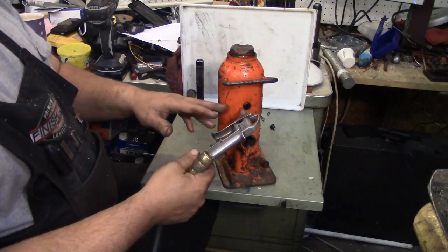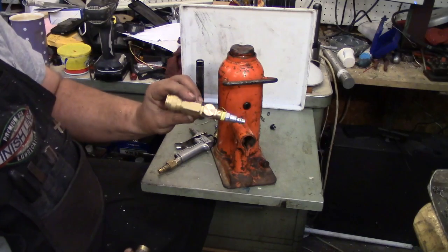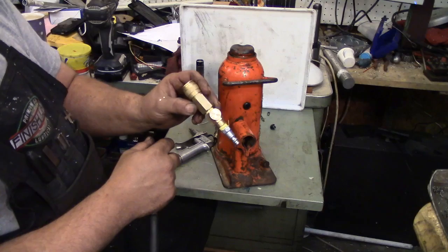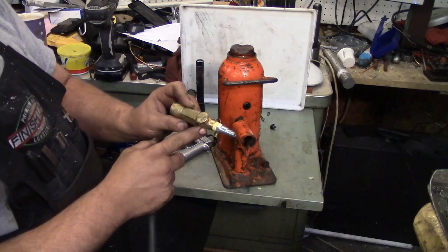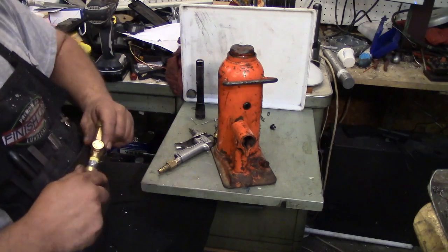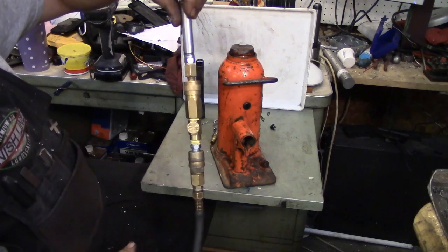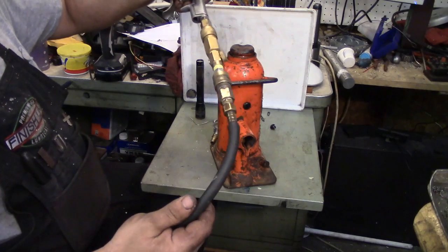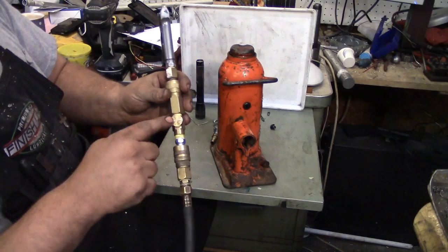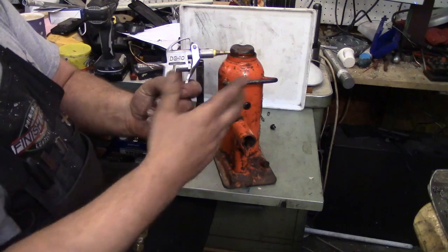If you're concerned about the air pressure, I put together one of these - it's basically just a valve with quick disconnects on the ends. These are available from Harbor Freight, five or six bucks. They're touted as an inline regulator, but they're not. It doesn't regulate anything except volume. It's really just a volume knob for air, because there's no diaphragm, no bleed-off. You can't turn it down and get 12 psi - you're going to get whatever your hose pressure is, like 100 psi; it's just going to get there slower. So it's just a volume control, basically a valve. I just use it to turn my flow down, which makes this part more manageable.